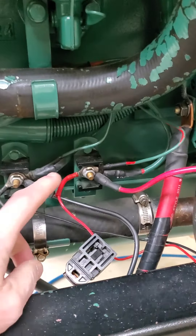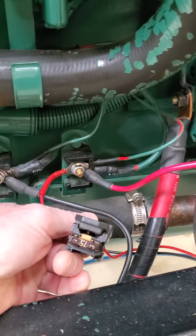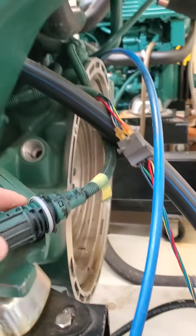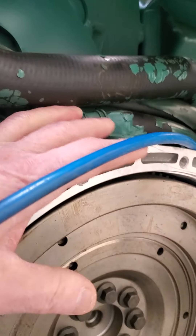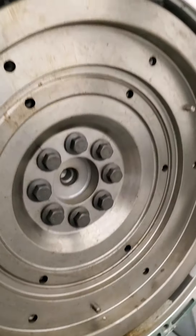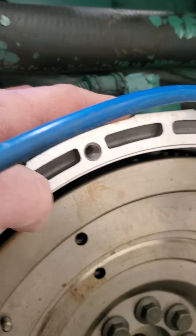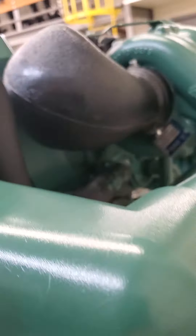Here are the two connections that tie into the EDC engine. Down here you've got your main fuse going up to the EDC platform. Right water inlet. Around the back side of the engine is where you time the engine. This one doesn't have a gear or drive on it, so we can see clearly that up on the top of the flywheel housing is where your speed sensor is — it reads off the flywheel. Being it's an open flywheel, if there is any corrosion in there, it's a magnetic pickup and that corrosion can cause the speed sensor to act up, so that's another thing to look at.